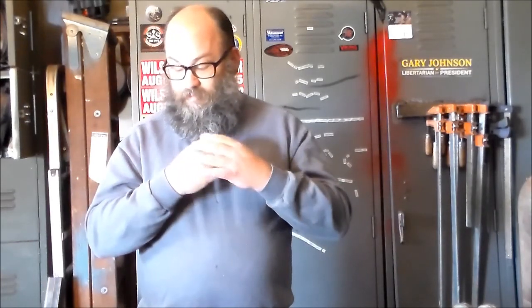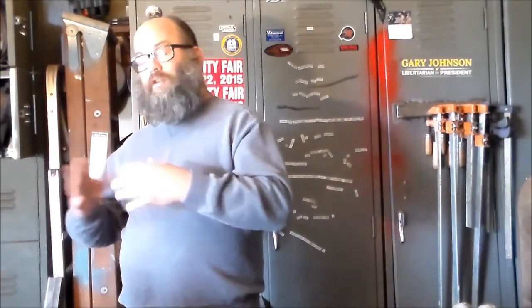Now the steel maintains the same outward shape — this one has been annealed, this one has not, and outwardly they are identical, but inside the steel is in a totally different configuration. The third step is grain growth, where the microstructures of the grains reform and the original strength is lost. But you can always take it back — it can be hardened, it can be tempered. This is just to soften it. So those are the three steps of the annealing process.